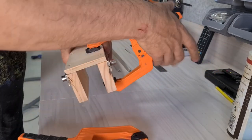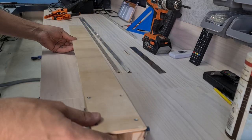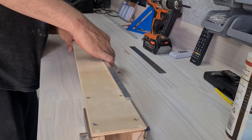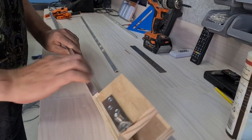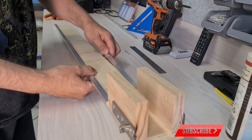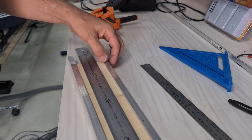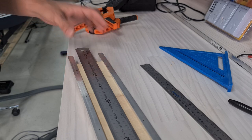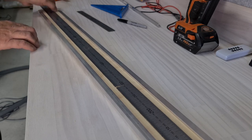I've moved the clamps — they're ready to go. As mentioned earlier, I'm going to put these aluminium strips on; I just need to work out that they're not going to go the full length. I think I'm going to have them this way, then I'll drill some holes in the aluminium on the bottom and screw them from the bottom to make sure it's totally straight. There's an actual lip that this top board will sit on, and if I left these in place and only cut them to the edge, they'd be in the way. So I've cut the aluminium strips to length — you can see down this end there's enough for the lip that this board will sit on.